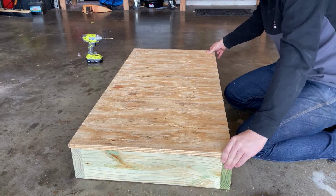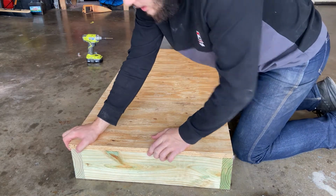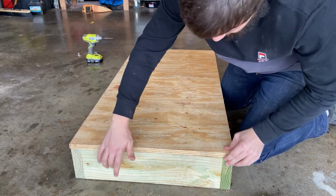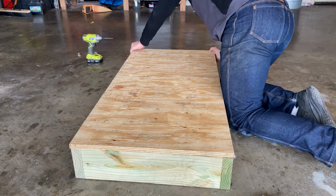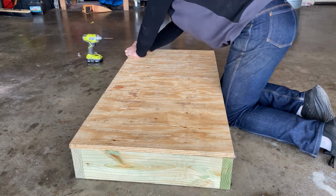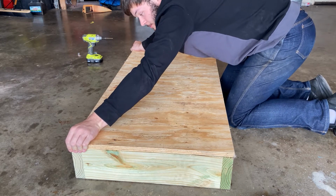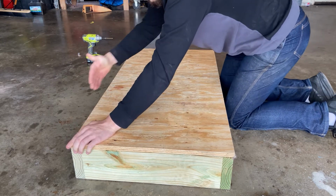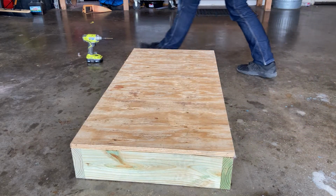Now, to get this guy perfectly lined up is a little difficult sometimes, if your box down below is not quite squared off. Today, mine is not quite squared off. So how do you take care of that? Just work on one sideboard, and for now, just put in 4 screws.